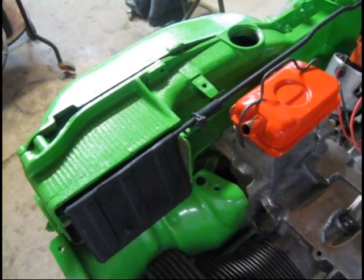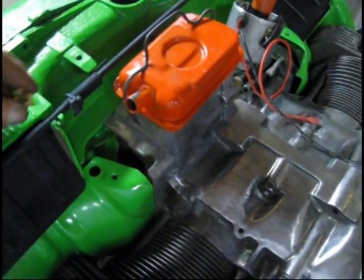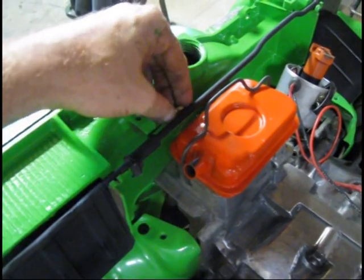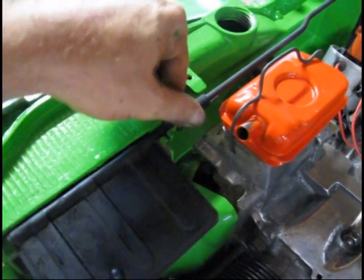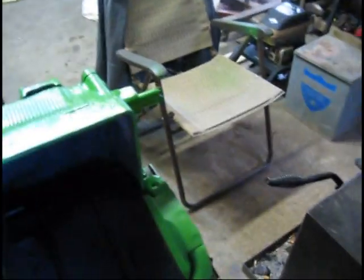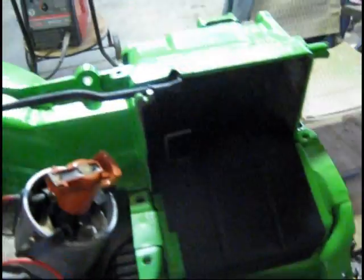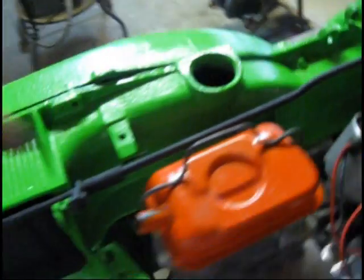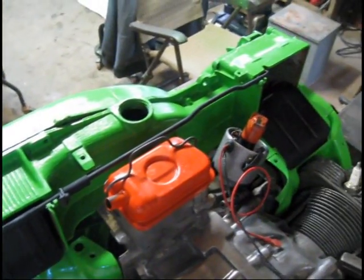Alright, let's go ahead and get these flaps installed. We've got these little bushings — they're going to snap around this rod in this position and then they just push down in there and they let the flaps open and close. We've got a few things to do here. On this side I've got to pull this up and it's going to snap around that right there. You've got to get the retainer and get my spring tension set. I'll do all those things and then give you a shot of how it works.